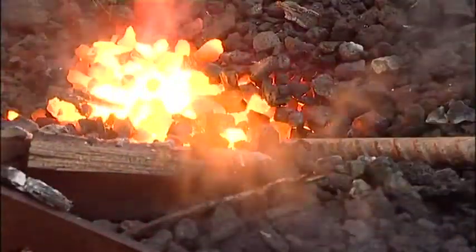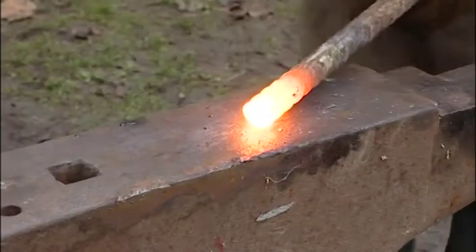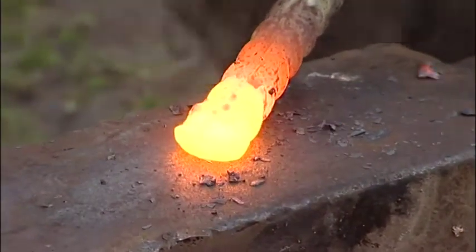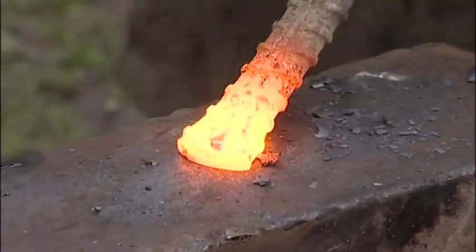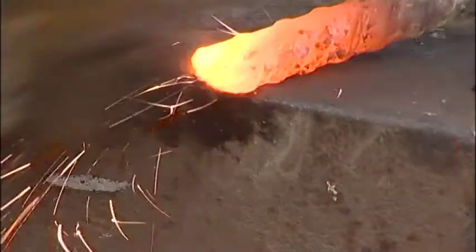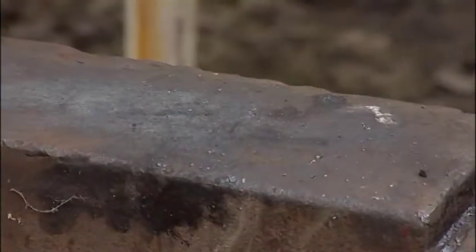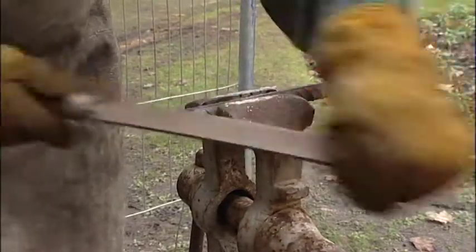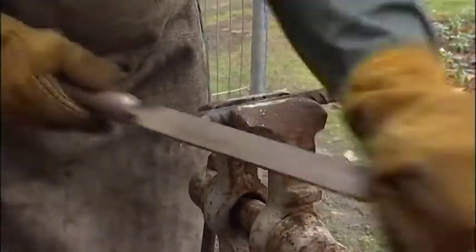Cold chisels are an essential part of any builder's toolkit, but a variety of sizes and lengths can greatly improve their versatility. Effective chisels can be made from reinforcing bar forged to the desired shape and length, and then hardened and tempered for use. Following the forging process, the grain or crystalline structure of the metal becomes distorted and vulnerable to cracking or damage. Cleaning of the surface removes distortions and undulations which can induce weakness and also allow for a more effective observation of temperature in the hardening and tempering process.